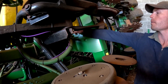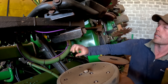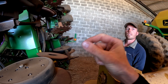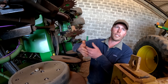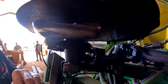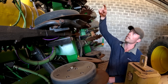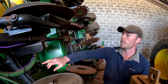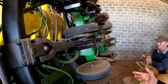This is just a one-way valve, and this tube is a friction tube — so that keeps the pressure equalized between units. It acts as a strainer like an orifice to regulate pressure, but there's no screen that can get dirty or clogged. The hole in the hose is very small, and the length of this tube and the thickness of that hole were calculated. The number of units determines the length of the tube and the friction, so you don't have to have a screen and the pressure is equalized. That really gets rid of the maintenance issues of liquid application.